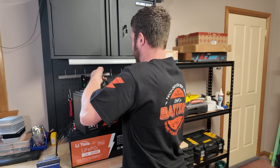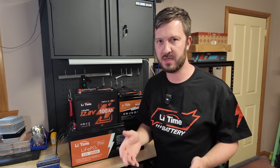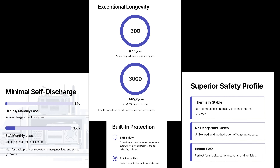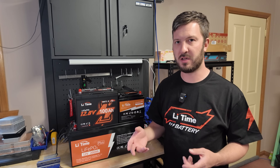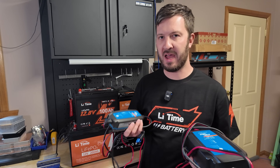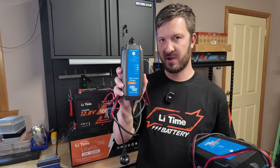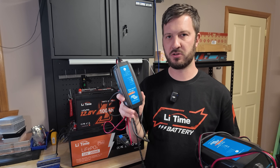I'm a big fan of LiFePO4. There are many advantages over sealed lead acid — obviously weight is the biggest thing, but they also have a higher cycle life, smart features like Bluetooth in the 100 amp hour version, and better voltage stability under load. They're great for multiple purposes, not just ham radio. I now struggle to think of situations where I'd use sealed lead acid over LiFePO4. With LiFePO4 batteries you need a compatible charger — the ones I use are the Victron Smart Blue chargers. I've got a 25 amp version for the larger batteries, and a 5 amp version for the 50 amp hour battery. These are very reliable and highly resilient — a great choice if you're looking for a smart charger.